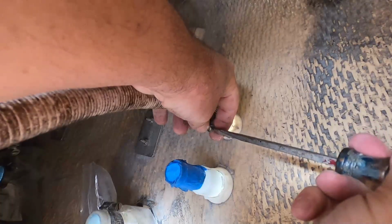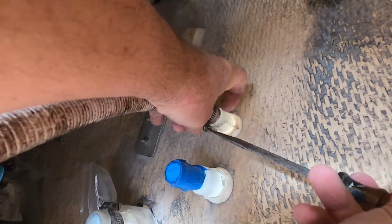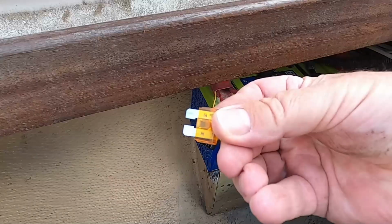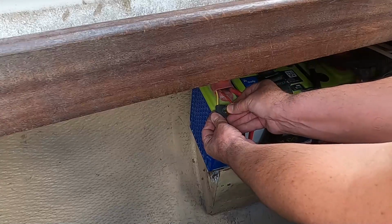So that probably cost me a bit of electricity usage. Not a big deal. I'm pleased to know that that bilge pump works, because this is actually the third one I've had in this boat for the primary. So I'm glad that that's working. I've got to get those hoses on now. I really need to use a nut driver instead of a screwdriver on these things. It's just idiotic. My pumps run directly from the batteries. There's no switch, there's just this fuse. Let's put that back in.